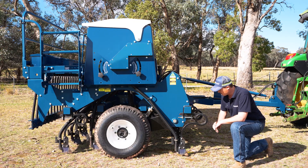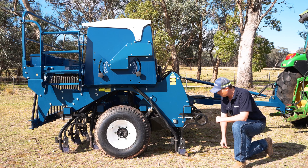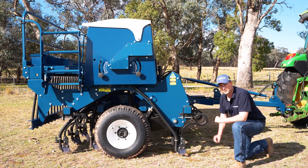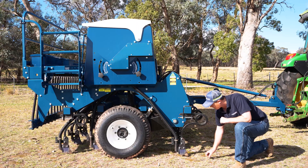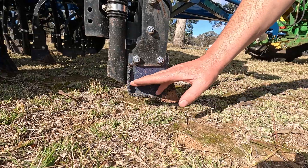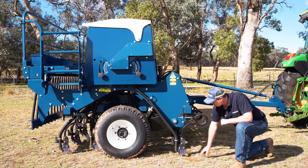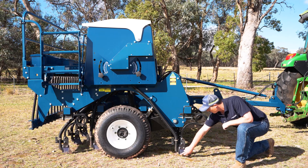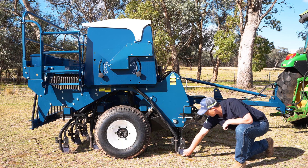Today we're calibrating the machine set up for wheat, so we're looking at a sowing depth of between 20 and 30 millimetres across the machine. Now it's really important to understand the angle of the baker boots. While it might seem quite deep at the front, we need to look at that at a horizontal angle at the rear of the point. We're actually looking at the nose of the point to get it in a little bit deeper than the required sowing depth, so that at the back of the point where the heel of the baker boot is setting our seeding bed, that will set the correct seeding depth.